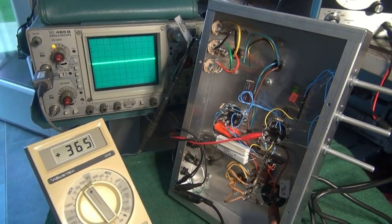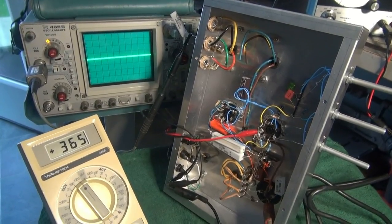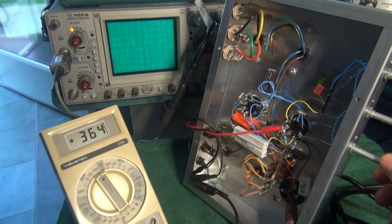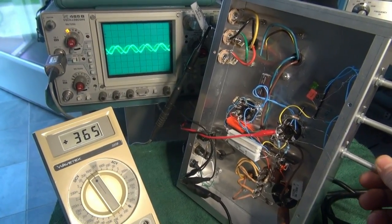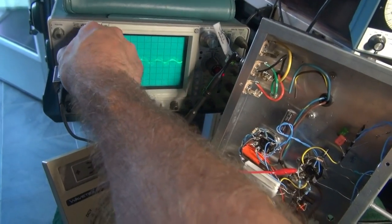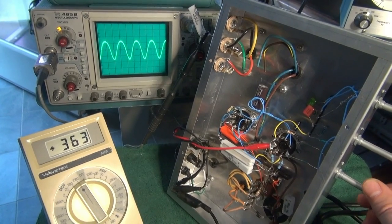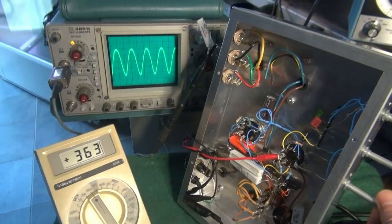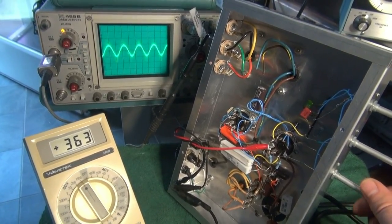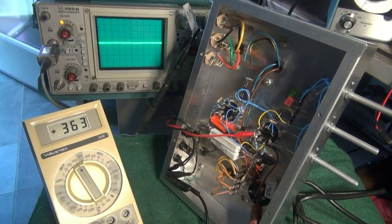Wiring is mostly complete. I still have not hooked up the input jack — that's going to be a remote setup through a coax. I'm monitoring the amp right now on a Tektronix 465B. You can see the high voltage right there, hovering around 360 volts. Bring up the volume — you can see the output over there on the scope; looks nice. High voltage hangs right in there. Now let's crank on it — you can see the little square wave, nice clipping. Almost a perfect square wave when you really crank on her. So this thing should be a real honker. It's nice and clean — very responsive treble. Next step, I need to get that input jack hooked up, get her in the cabinet, hook up to the speaker, and then we'll see what it sounds like at audio frequency rather than on a scope.